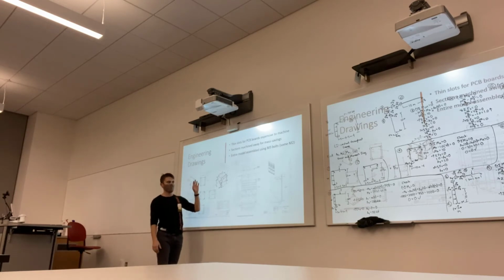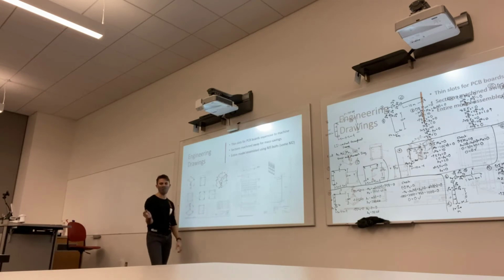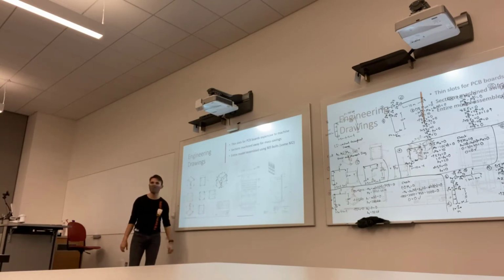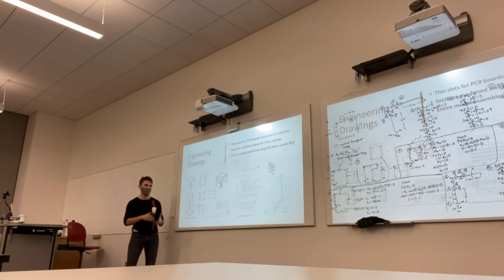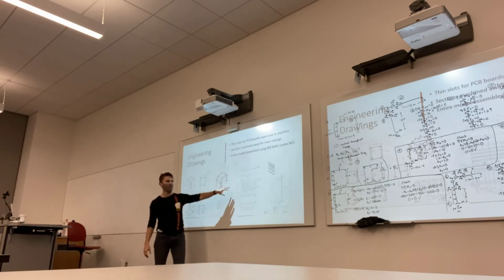The problem with these is that they are fairly expensive to machine because those bits are 1.8 millimeters. If you know anything about feeds and speeds, you have to run those really slowly. And when you have machinists that are getting paid $80 an hour, and you haven't done slot sizes like this before, it gets fairly expensive when you do non-standard bit sizes like that. Really long, really small, thin rails.